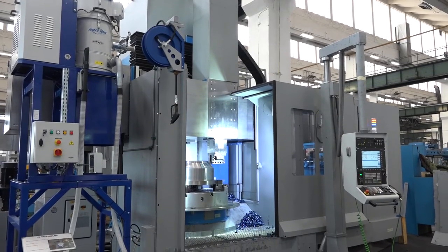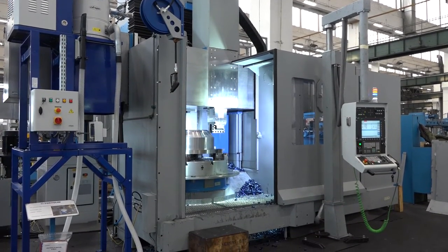This is a two-axis model, but you also have a W axis to assist in getting to the right position with the ram. That's to reduce the length of overhang of the ram. If the cross rail is fixed at one position and you're doing very thin or low parts on the table, you'd have the ram extended to its maximum. The W axis lets you move down in increments of 100 millimetres to reduce the overhang, giving better tool life and better rigidity.